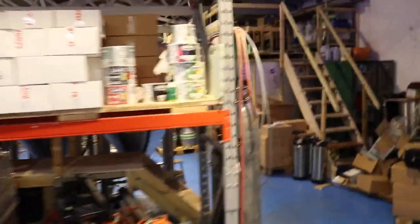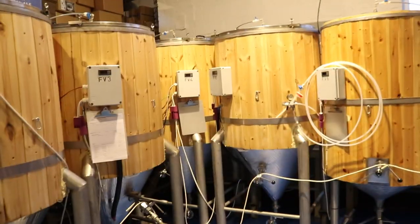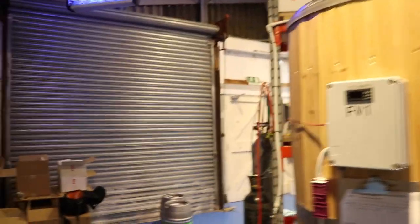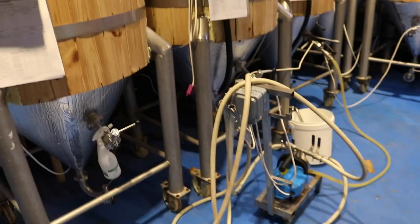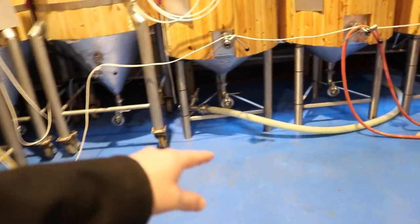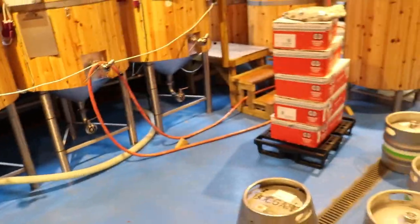What I was gonna do is pop the tops off all of these tanks, give them all a quick rinse, and then set them all to caustic one at a time. And then once we've done that, while that's running, I can be getting on with moving stuff around — set a timer for each one, normally about 15 minutes caustic is good enough per tank. Seeing as I'm going to be doing all of them, I was tempted to skip the drain hose, but no, let's use what we've got properly. Trying to think of ways to shortcut it already.